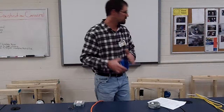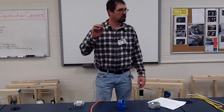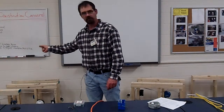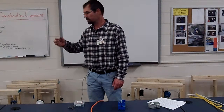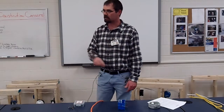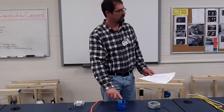Your wall plate is not going to be tight to the wall if the box sticks out too far. An inspector goes around with a little thin card, and if he can slip that card anywhere around the cover from box to wall, it doesn't pass. So they have to mount flat to the wall — if there's a gap, it does not pass. That all goes back to how these are mounted.